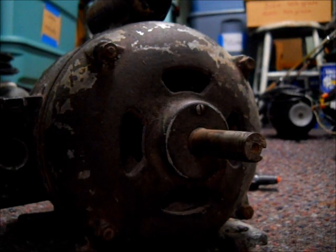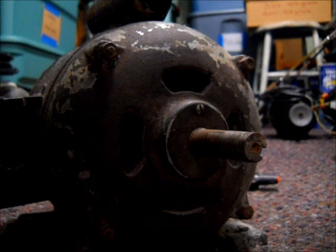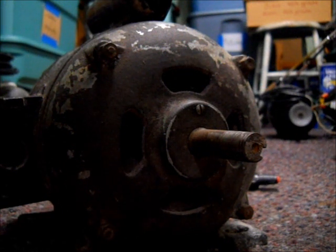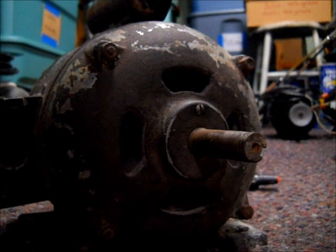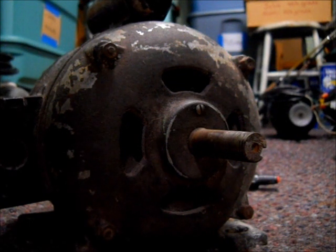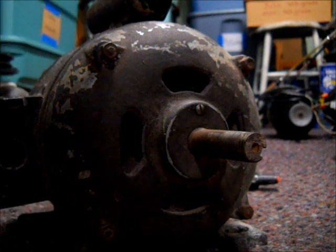While the motor was running, I don't know if the camera picked it up, but it's still making a little squeak noise and still has a little grinding noise, especially after I unplugged it. This motor was on an exhaust fan, and looking inside I can see there's a little bit of dust in it. My guess is some dust got in where the bearings are and might have scratched them up a bit.